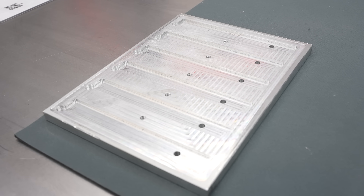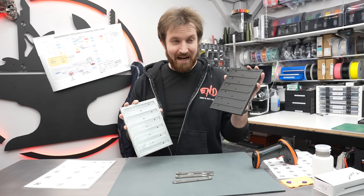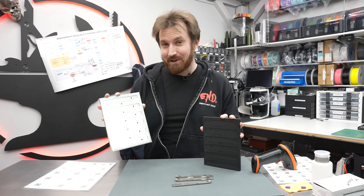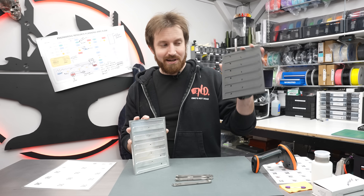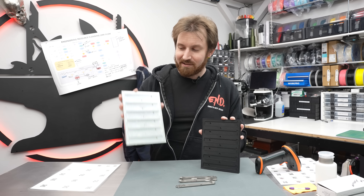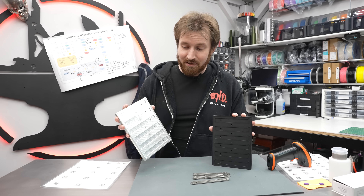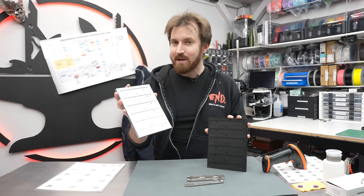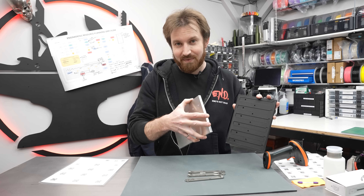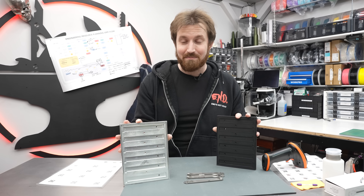Two perfectly functional jigs we can use in the Carvera to clean up these spot welds. The 3D printed one actually took about an hour and a half longer than doing the aluminum one, including the CAM programming and part setup. 3D printing gets all the love these days because it's the new hotness and it's really fast — but the place that CNC machines still come out on top is their ability to make things out of metal, and when you're making a large part, it's way more effective to remove material than for a 3D printer to add all of the material. That's why making an aluminum fixture was actually faster than 3D printing, including the CAM programming time.